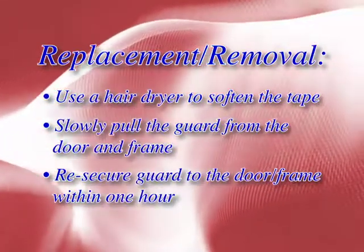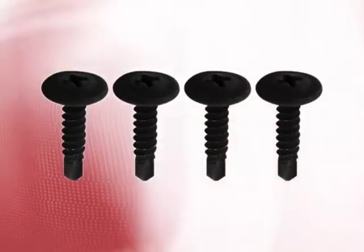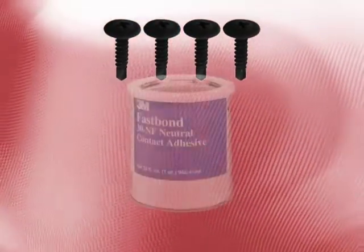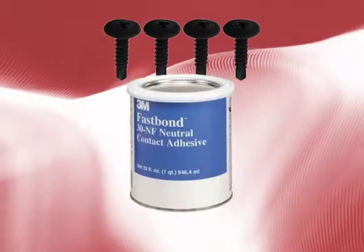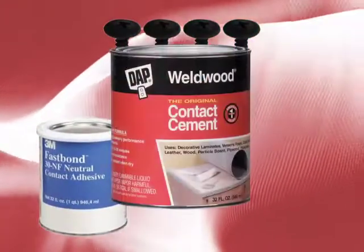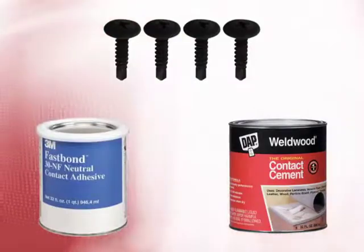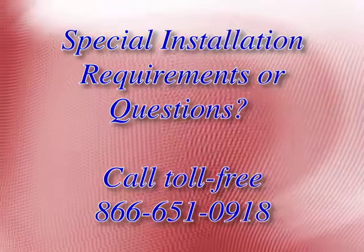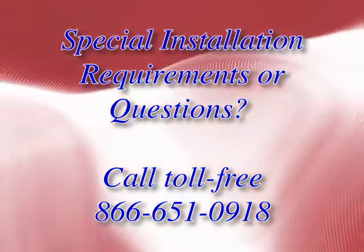If the tape has lost its tack, reinstall the guard, either using number 8 by 3/4 inch self-tapping wafer screws, 6 inches on center, or re-secure with good quality contact adhesive, such as 3M's Fast Bond or DAP's Weldwood, available at most hardware stores. If you have special installation requirements or questions about the procedure, call us first before you begin. We'll be glad to answer your questions.